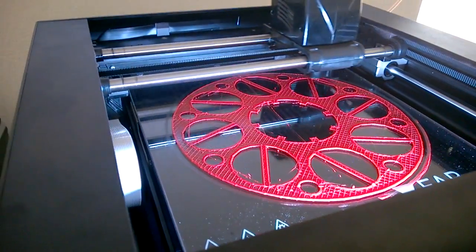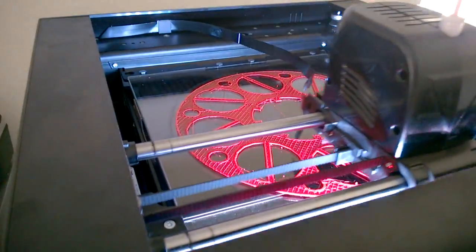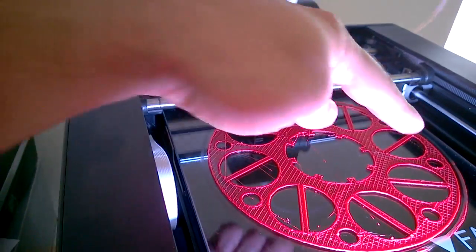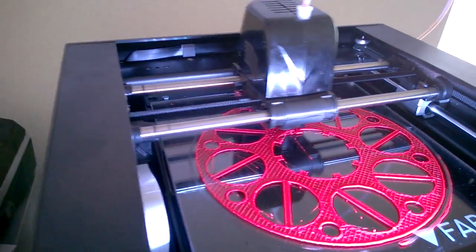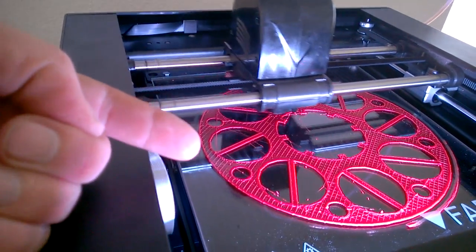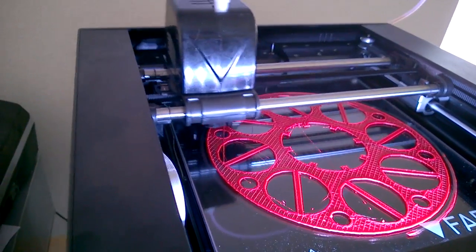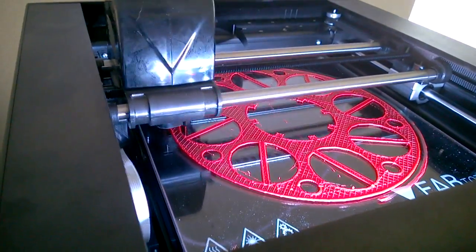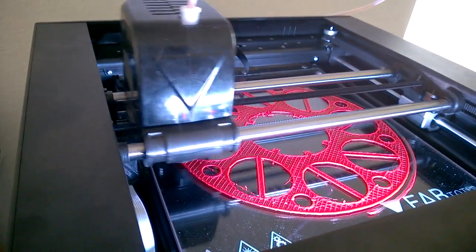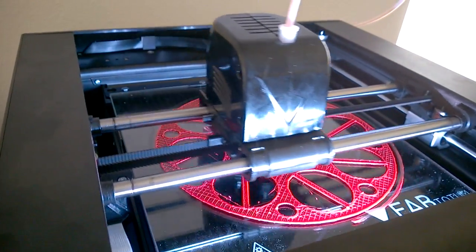I think one of my suspicions is that it's partially due to the fact that there's no good way to calibrate the bed exactly, so it's a little bit higher on this side still than that side, even though I keep messing with it. I've got it real close but it's not perfect. So I think once it gets over to this side, what might happen is it may either contact on the lowest layer, or it's so close that it's just creating a lot of resistance, and then that's causing the filament in the cable to jam up and then the extruder motor to bind up.